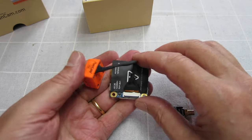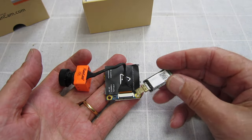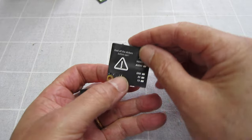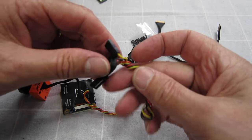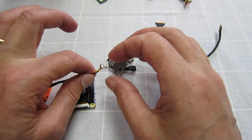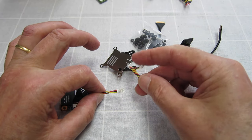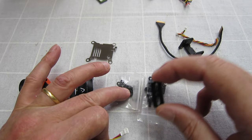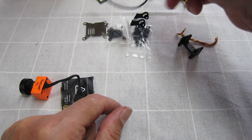Let's take the camera out. It's the same split setup — the camera and the control board. There's the little WiFi dongle for configuring it using the WiFi app. We have paper stickers just to stop it being damaged in transit. All the connections are down the side. There's the USB connection which gives you video out and power in — 5 volts only when using USB. A little 3-pin connector, male and female, which you solder onto the board for connections to your flight control board. Different mounts, standoffs, and rubber isolation washers. And we get a longer ribbon cable so we can mount the camera further away from the board.